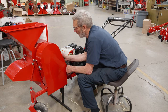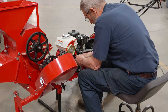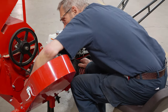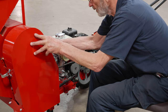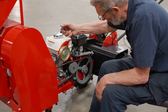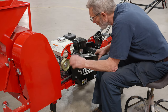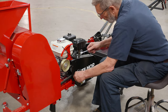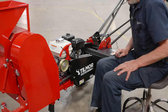Make sure the belt is on at each end. On this machine you can actually open the shield and check to make sure that the belt is on everywhere like it's supposed to be. Lift it up, slip it on, close the shield back up. It's ready to go — all's good. Put the shield back on, tighten it down, and it's ready to run.